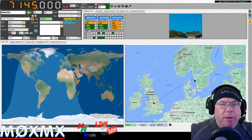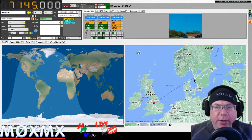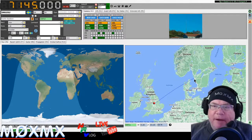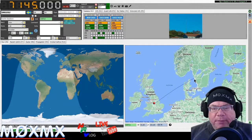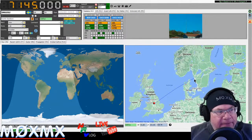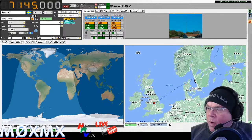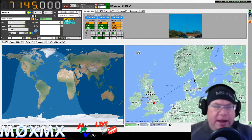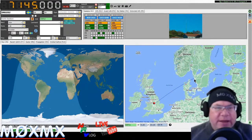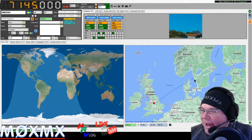Roger. Thank you very much for coming back to the call, Svante. Is it Svante? Is that how you say it? Sorry. I can see you on QRZ, and that looks like a fine antenna that you have. I can also see your location on the map as well. And yes, I'm running a Flex 6300 with 100 watts into a wire dipole antenna, only around about 7 meters above the ground, which is for 40 meters with 80 meter loading coils. So nothing special this end. Maybe you can just confirm the pronunciation of your name. From Mike 0, X-ray, Mike X-ray, over.